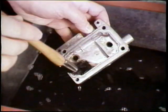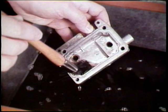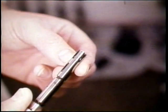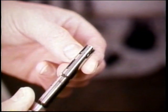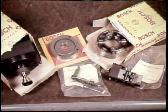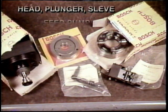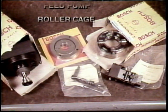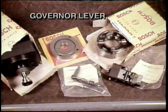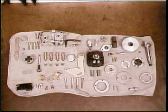Inspection. Now wash all parts thoroughly and inspect for wear — replace any worn or damaged parts. Smart mechanics coat all parts with test oil to preserve the surface finish. The control edges of the pump plunger must be sharp and the contact surfaces must not show excessive wear patterns. If you must replace parts, remember that some are replaced as assemblies. You'll use a replacement kit of O-rings, gaskets and seals whenever the pump is reassembled. When you've inspected all your parts, you've completed your job of disassembly of the VE distributor pump, brought to you by Bosch.